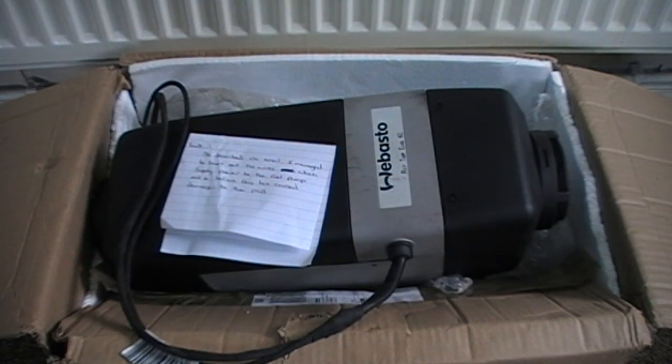We've got something slightly different today: a big Webasto Air Top Evo 40. This is Aaron's unit - there's been a bit of an accident. It's quite new; he fitted it, it was working, and all he had to do was tidy up the wiring. In that process he accidentally shorted the fuel pump line and now it's throwing a fuel pump fault. A replacement ECU for this is £580, and since these aren't as common as a Thermotop C, you can't just get a cheap one off eBay.